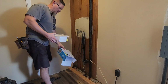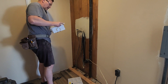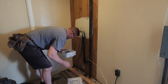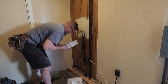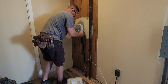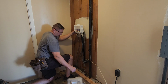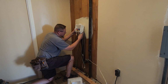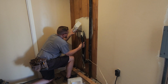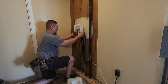So I just got this washing box. It uses SharkBite connectors, which is pretty handy. And then it comes with this beautiful trim ring, but it has knockouts for the drain already built in. And it looks like that drain is actually a little bit smaller. So that's good. We can use the smaller size knockout in the bottom of there.